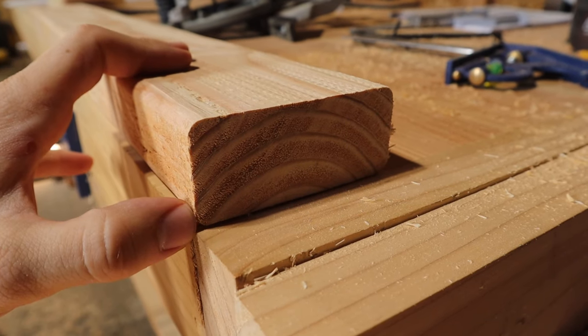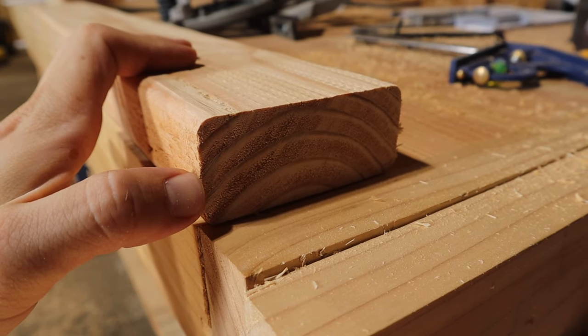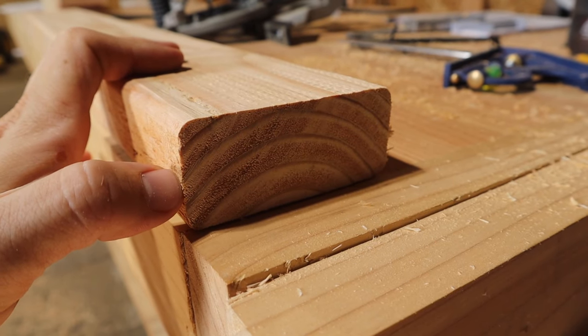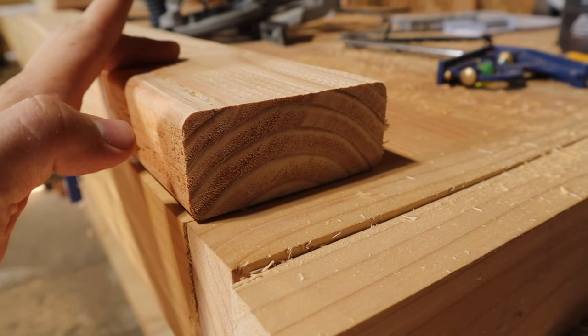And so in this case, if you've got a 1.5-inch board, divide that by 2 and that's going to put you right in the middle, and then divide your bit in half and you're going to subtract that off. So rather than taking down to 3/4 of an inch, we're going to go 3/4 of an inch minus 3/16 of an inch for a 3/8 bit.